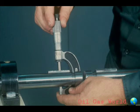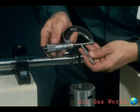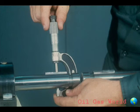Measure from the top of the key to the bottom of the shaft with an outside micrometer. Then measure from the bottom of the coupling bore to the top of the coupling keyway. Compare the measurements. The measurement of the coupling bore and keyway should be two to six thousandths larger than the measurement of the shaft and key. This is to ensure some clearance between the key and the top of the keyway when the key is installed.